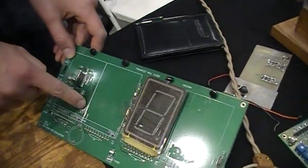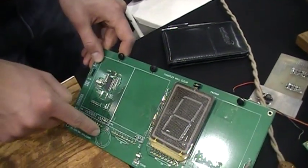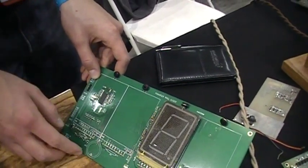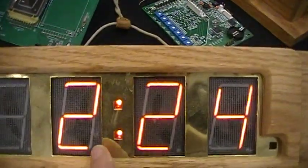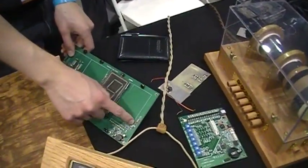So is there a drive transistor for each? There's a row of driver transistors here for each set of segments and then one for each of the digits. What type of microcontroller? This is a PIC. I see the extra neon bulbs are for the dots — for the colon, right. And then there's one here for the AM and PM indicator as well.